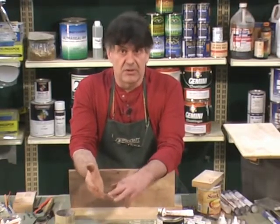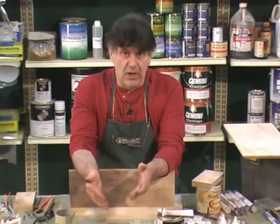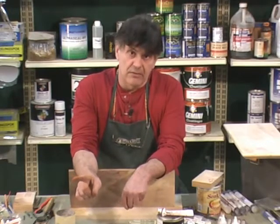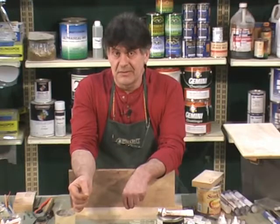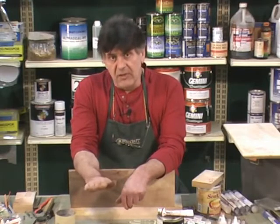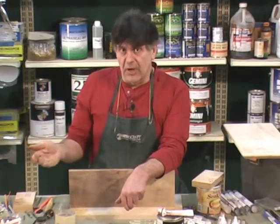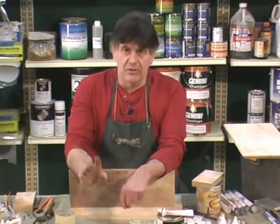When you're dealing with redwoods, cherry, redwood, mahogany, woods that darken, if you match it in a natural state, once it ages a little bit, it's not going to match. It's going to be lighter. So always take your filler a little bit to the darker side. In the case of woods that lighten, walnut and a few of these, to stay within the range of what you've got usually works, because it's slower lightening than what the redwoods are darkening. And even if it does show up just a little bit darker down the road, it's usually not real noticeable.